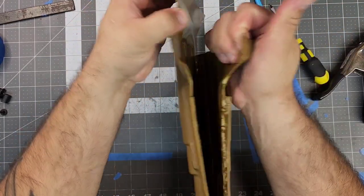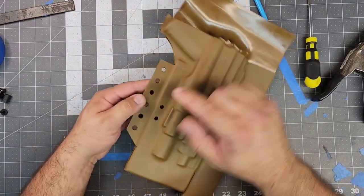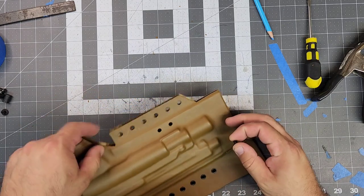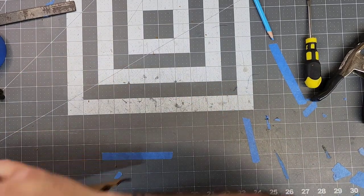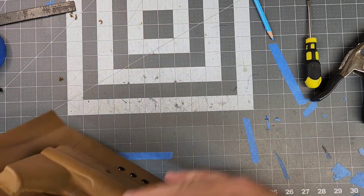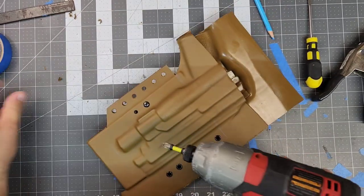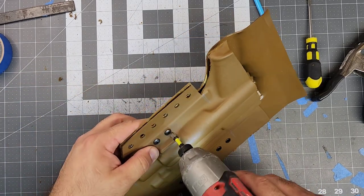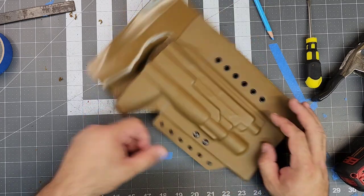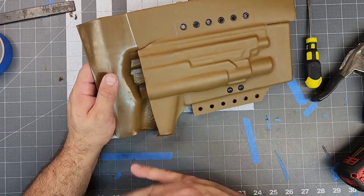So we have a cut. We have it split. Mold is out. The actual new mold is in the press right now. So the reason I leave the eyelets out of this to open it is so I can add the retention. Because when you have this and you add the retention after the fact, it is a major pain in the butt. So I went ahead and I got the material I needed. I can throw it in here. And then after the fact, we can go ahead and put those eyelets in. So I'm going to go ahead and do that now and then I'll finish cutting around the outside edge. But I'm not going to cut where the trigger guard is because I want to physically have the mold in place so I can see where the guard is going to end — I don't want to cut too far over and expose a lot of the trigger guard. I'd rather cut too far back and slowly work my way forward.